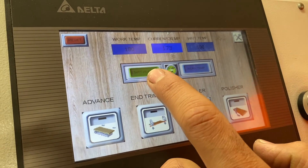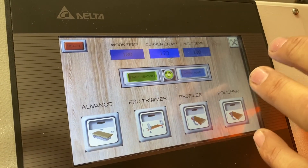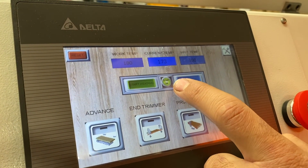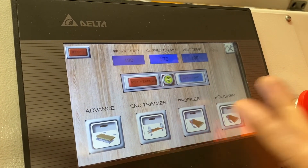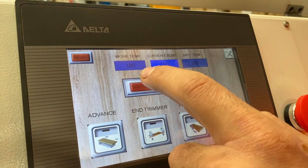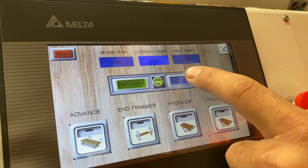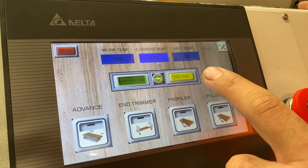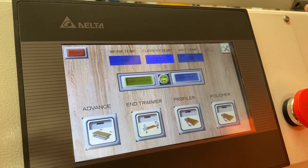At the bottom we've got 'start heating' — currently that's on, meaning there is power to the elements to heat up the glue pot. You can see the temperature OK light is lit up telling us we're at temperature. If we want to turn the glue pot off, hit 'stop heating' and it'll start to drop the temperature slowly. You've also got 'working temp' which heats up to 180, or 'wait temp' which will drop and maintain 100 degrees. When we want to operate, we run it at work temp.